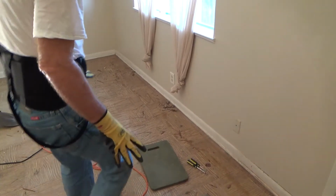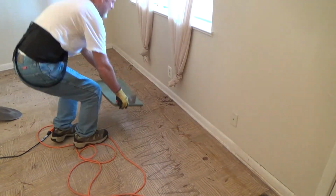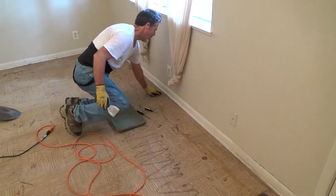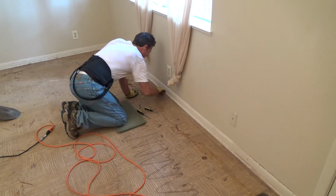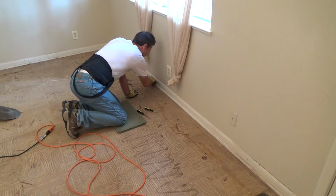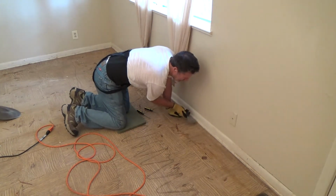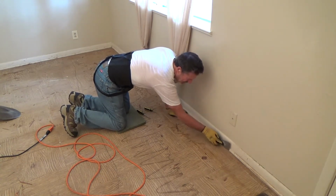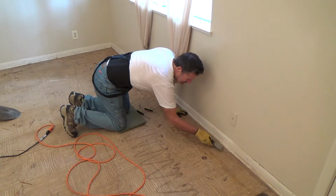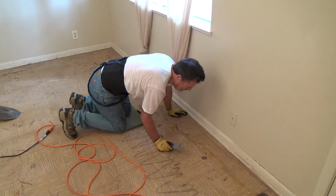Because I'm going to float a veneer, a resurfacing concrete material over this, I want to make sure that my tile isn't loose anywhere and that it's cleaned up along the edge, because I'm going to have to float this very carefully. See, there's a little bit of carpet edge. I'm going to have to float that very carefully along that edge. That's going to be kind of tricky in itself. If I get anything on there, I'm going to have to clean it off. I don't know what else to do about it.